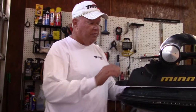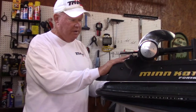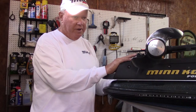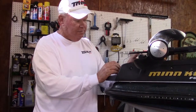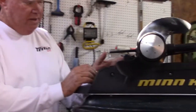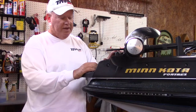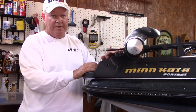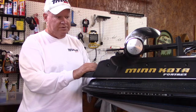One of the things, if you're shallow water fishing like myself, you want to make sure that your transducer here does not hit the rocks and get into a lot of debris, stumps and stuff. So I've actually applied a little block here, this little piece of aluminum, that blocks anything coming along the lower part of the lake. This is a good thing to add as a blockade for your transducer, to eliminate any interference of destroying or tearing up your transducer.